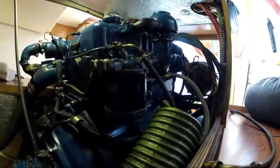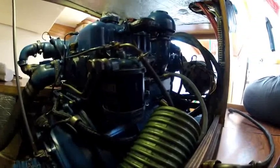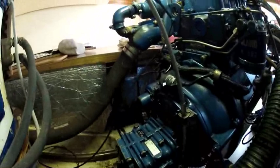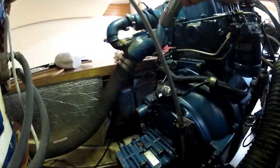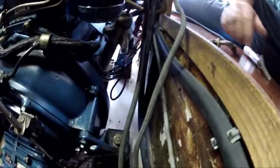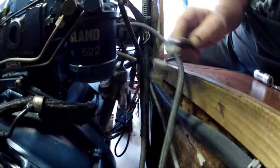Although it's mundane for many people, if you're watching this then you're probably interested yourself. That over there, if you look down there, is the primary filter. It needed to be emptied and cleaned out. From the primary filter the fuel ran all the way along down the bottom over there and it came up, and I replaced this hose because it was also leaking. This was the original — you can see it was pretty worn and stripped and that was also sucking air.